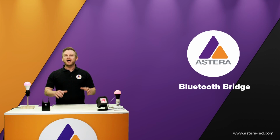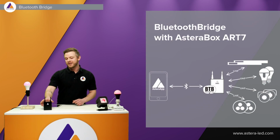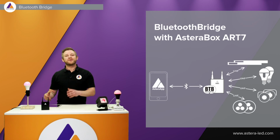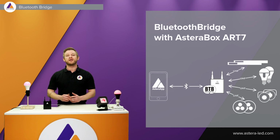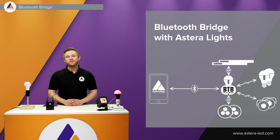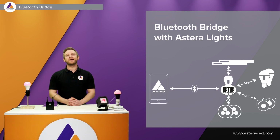This tutorial will be about how to manage our Bluetooth bridges such as the Astera box, but also the Bluetooth bridge which is built in to our newer lights. As you probably already know, we always needed the Astera box connected with our Astera app to be able to control the lights with our Astera app. Of course, the connection here is Bluetooth between the box and the tablet, and then UHF from the box and out to the lights. Now what we did with all newer lights such as the NYX Bulb, the Pixel Brick and also the AX9 was to build in the Bluetooth bridge directly into the lights. So we can use a BTB light instead of the Astera box.